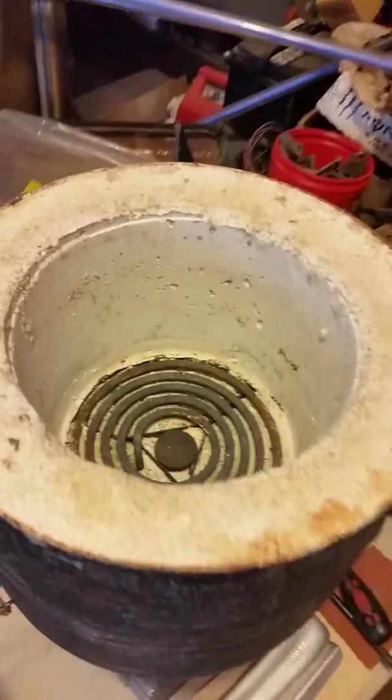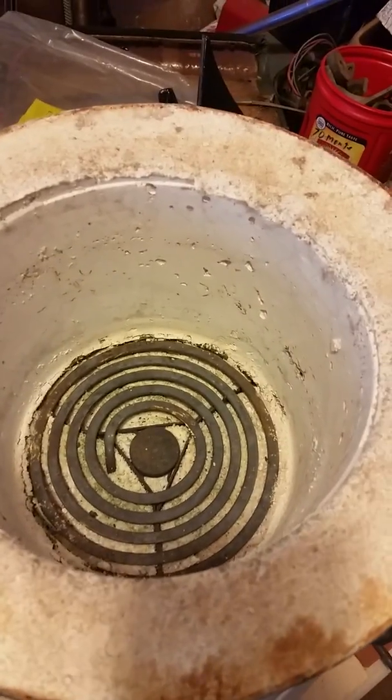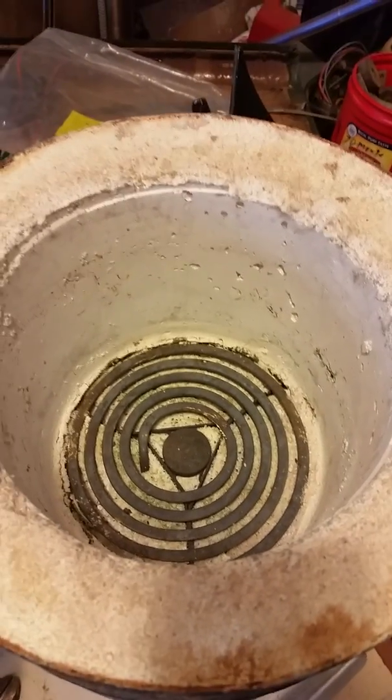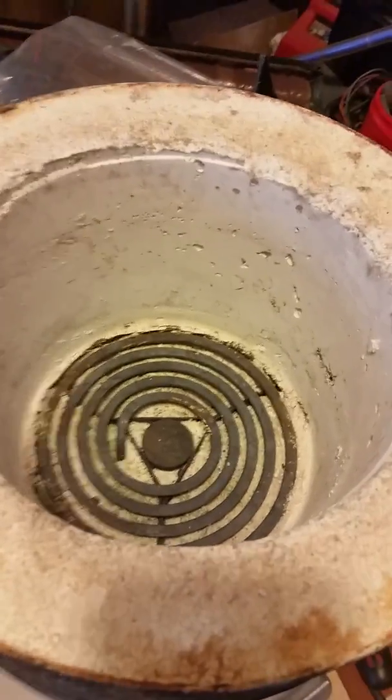The point is that it uses a stove burner on 220, melts aluminum, and it's not too slow either. Notice that the metal isn't touching. The wires aren't touching. I had problems with that initially when I was trying to just use foam insulation.